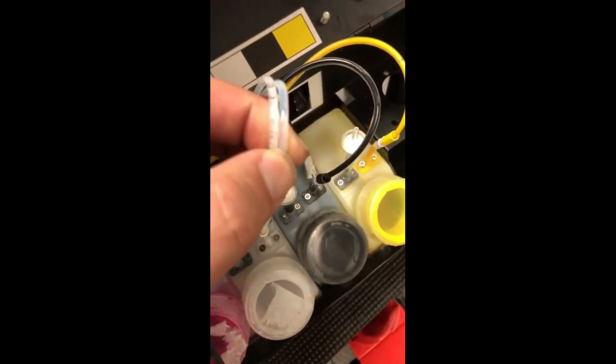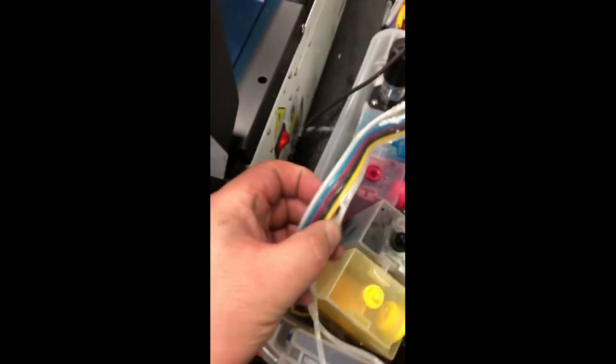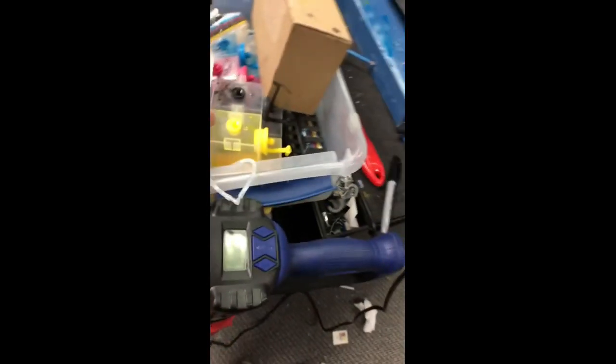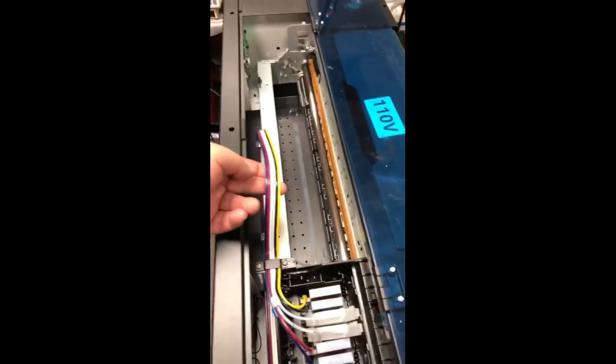The white ink is a lot thicker. The second flag is the tube — see how thin it is? This is how thick you want your tube to be if you're doing DTF. Let me grab it so you can see the difference. This tube is this wide and this tube is much narrower. A thinner tube means you're going to have clogs.